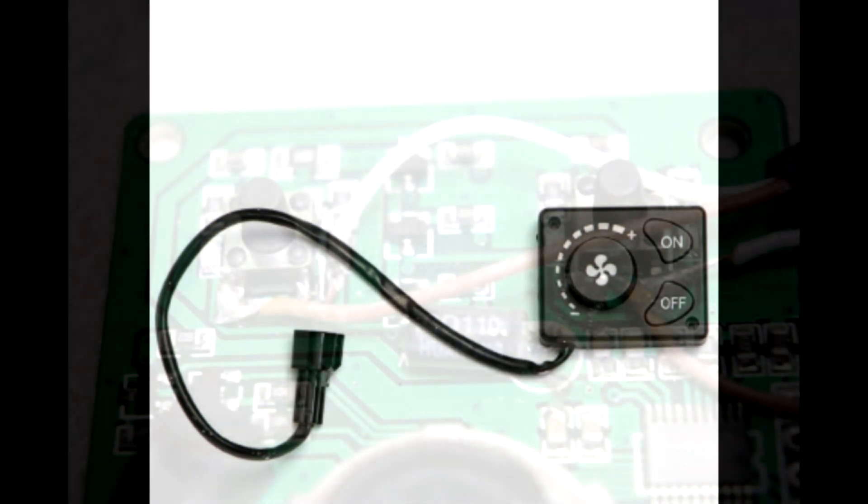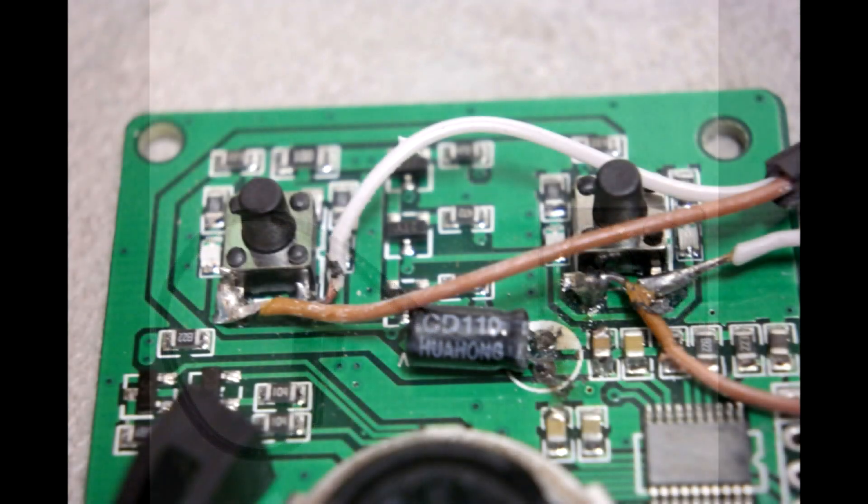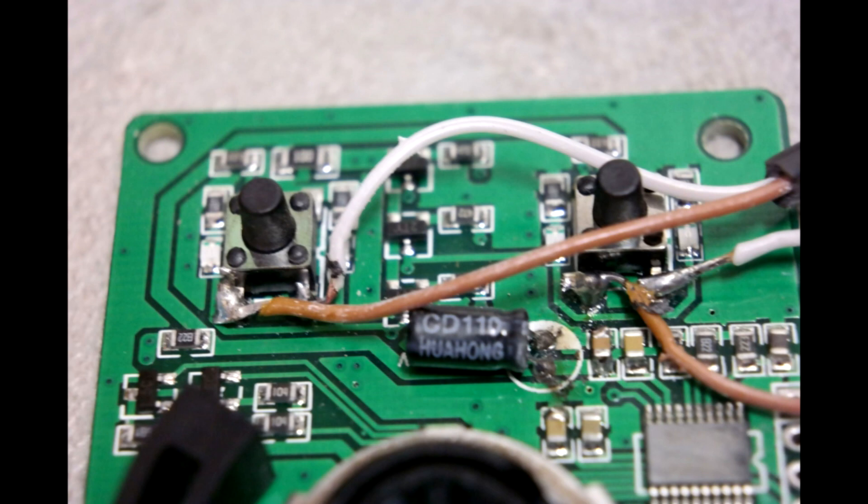Let's look at what Hank done with the rotary controller. The first one Hank had was the traditional black rotary one. Hank's use case required him to be able to turn off as well as on, so he needed a dual channel. There's no remote on these, so you're hacking directly into the back of the controller itself. You take the back off — the on button's the one on the left, the off button is on the right, and you can see the location of the terminals you've got to solder onto. If you just need on only and you've got a single GSM module, it would be the left one — the on button — that you'll be soldering into.